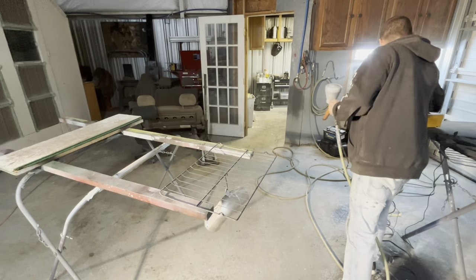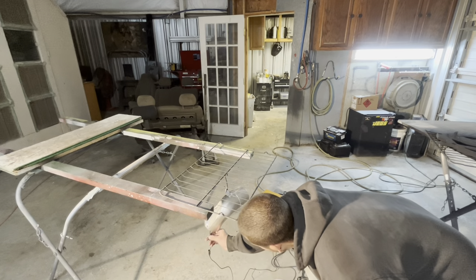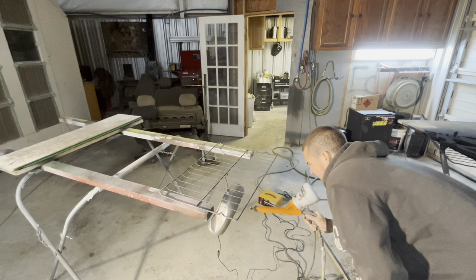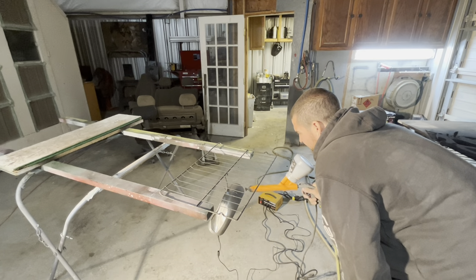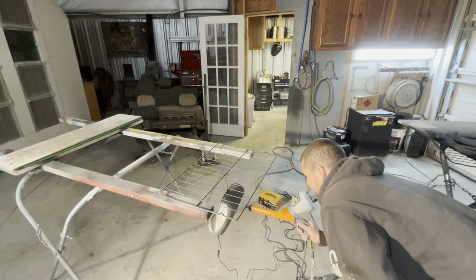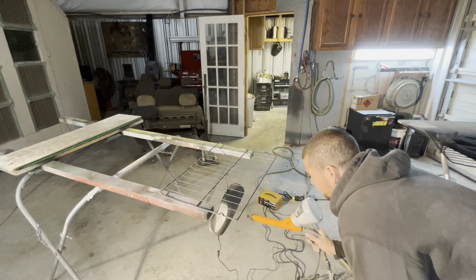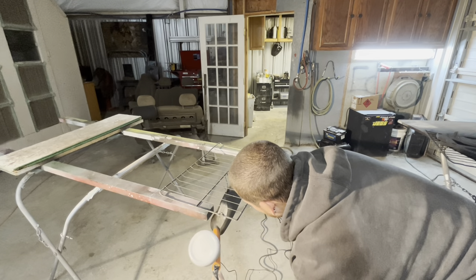Let's see if I can get this little piece down here. I'll put my clamp down here because the hose covers that up. I don't think I had a good enough ground on that bracket — I really don't. Because this one is sticking so much better. My dumb self was using a galvanized bolt. This one is looking so much better.